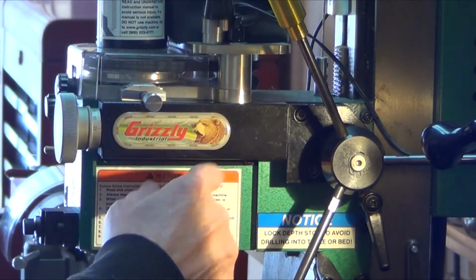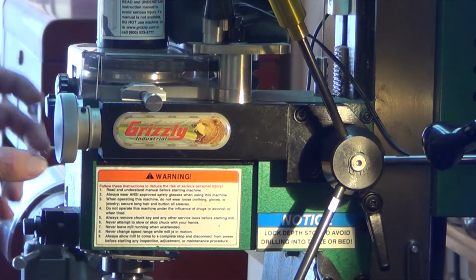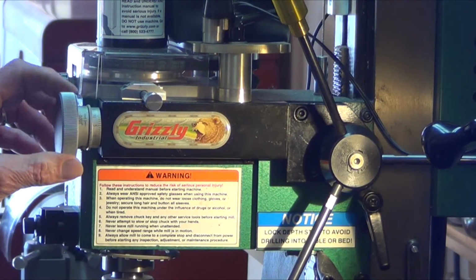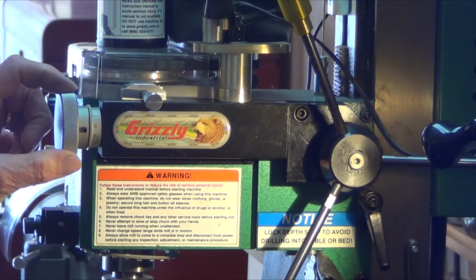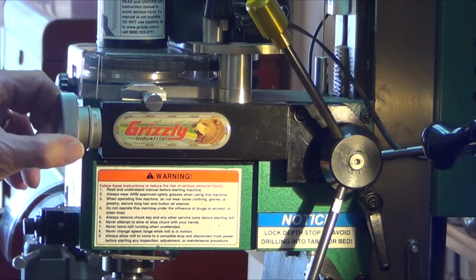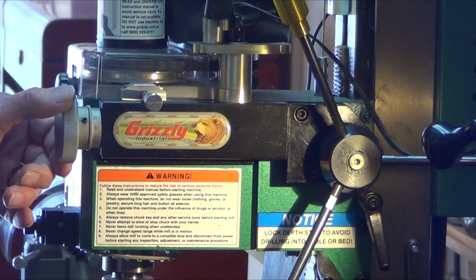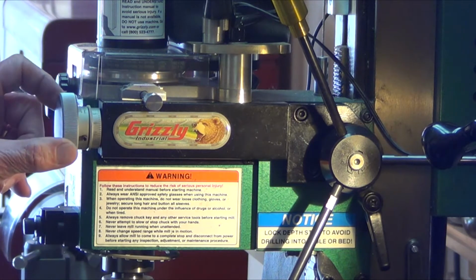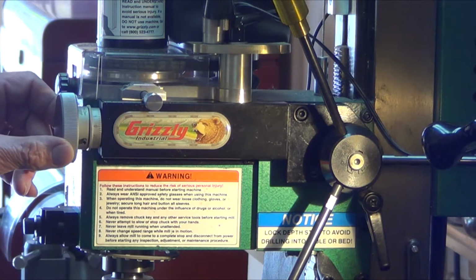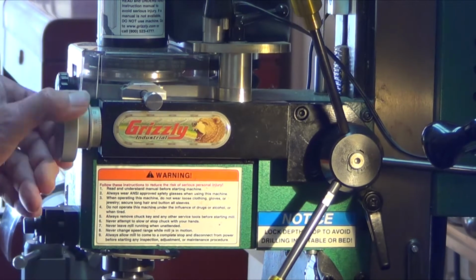That was a big piece. That was just a half-inch piece of stock aluminum. But I mean, you engage it, and it's so smooth. There's still backlash. Not a whole lot. If I push, oh, that goes down, so I don't know how I can tell the backlash until it starts moving. That starts engaging, that starts engaging. So that's 10, about 20 thousandths on the dial backlash.